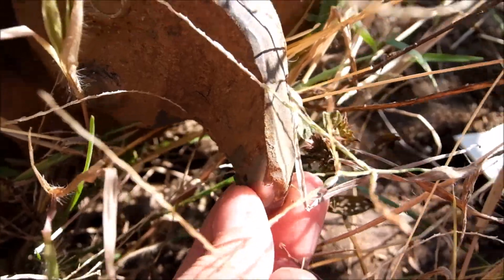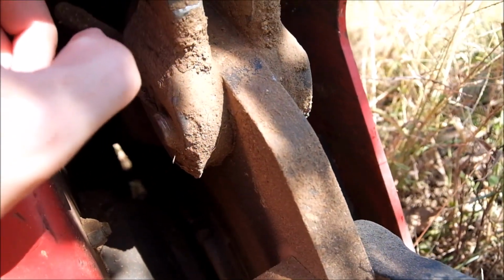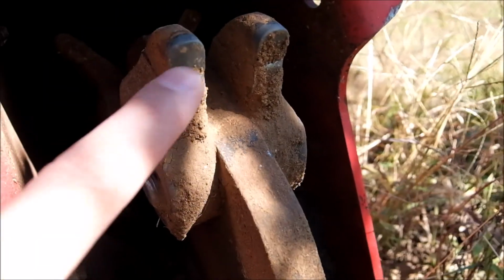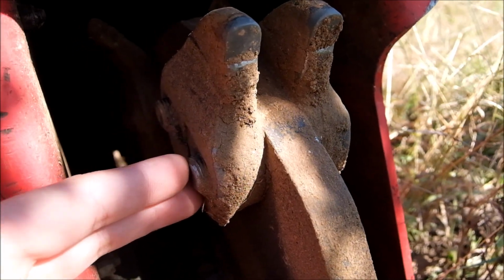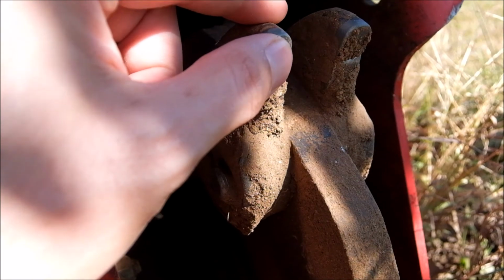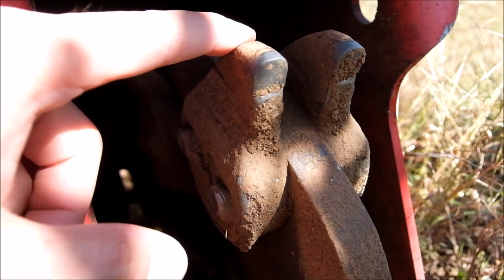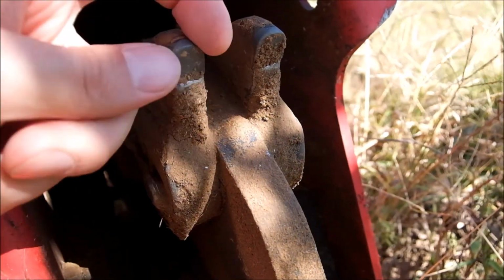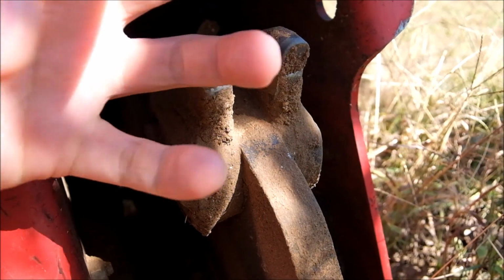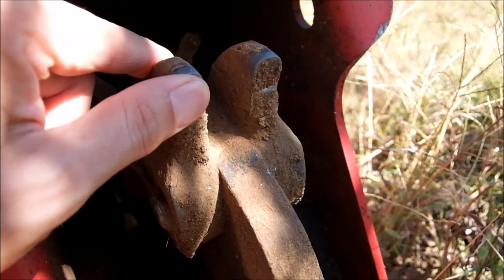And the story just keeps repeating itself. There's a few good teeth, and for the most part, they're bad. Why I wouldn't ever suggest buying this piece of equipment is because of these style teeth. You really can't sharpen them, you just have to replace them. They probably have a program where they sharpen them, but this edge gets so rounded that it's a ton of work. The other ones look like basically a bolt with the head as the carbide, and it's a cup that you can spin and have 3 different positions. That's a lot better option.